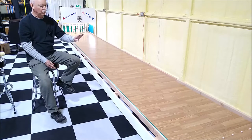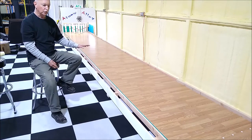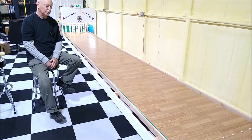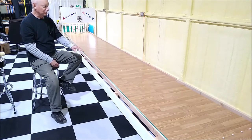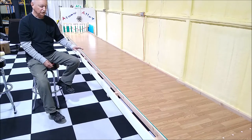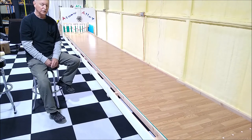You have to remember that a bowling alley is not a deck for a house. You're not going to put a barbecue on it, you're not going to put deck chairs, people aren't going to be walking on it — it only needs to support its own weight. So I chose 7/16ths OSB sheathing as the subfloor on top of a 2x4 ladder frame, and then used the least expensive laminate flooring I could find, which was 69 cents a square foot.